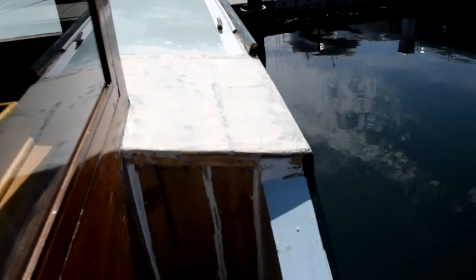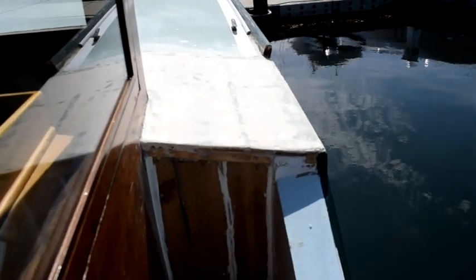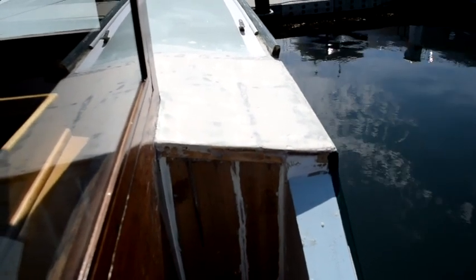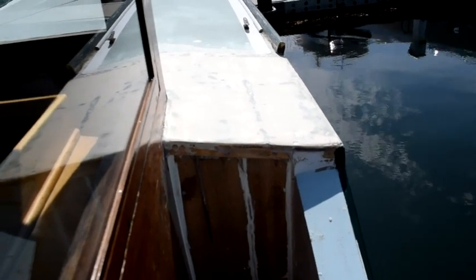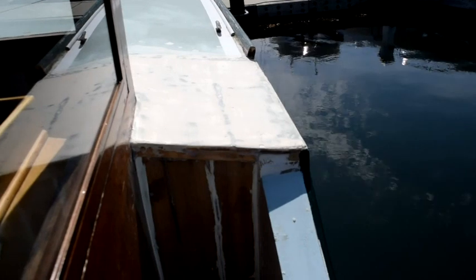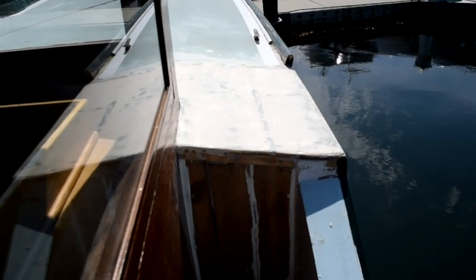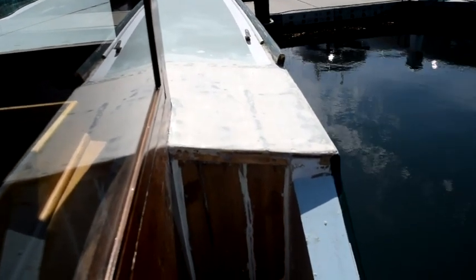Here's the deck from inside the boat. What I have to do is put another coat of fairing compound on, let it cure, and then sand it out — hopefully that will fill the imperfections. After it rains tonight and tomorrow, perhaps on Wednesday I can sand that out and get a coat of paint on. I'll paint the whole area white initially to provide my boundary color, and then I will repaint the non-skid paint in there with a green, I think — although I'm thinking I might change the whole deck to a buff color, I'm not sure. So I think I have pretty much sealed up all of the leak areas, and the system should be completely watertight now.